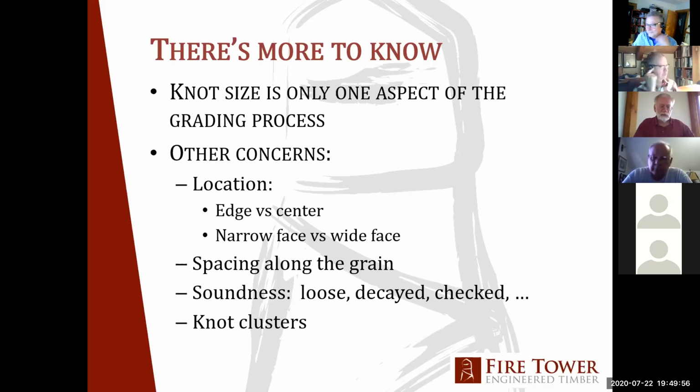Yeah, that's a good question. And what do you do with that? Most everybody on this is more interested in timber than lumber. With lumber, you've got a lot more sticks in a building, a lot more floor joists than you would timbers, so you look at them a little differently. If you're grading timbers, then the grade you determine for that stick is the grade you assign to it. What I normally do is work with the engineer to look at the load on that particular stick and see if it works with that grade.